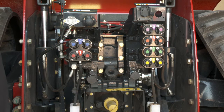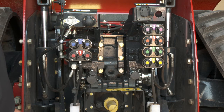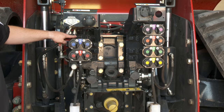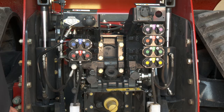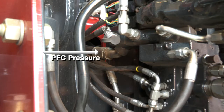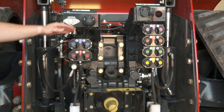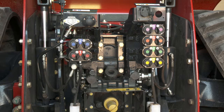We're going to take a look at the Danfoss remote valve layout. One difference compared to the Racine valves is these are in a vertical stack configuration on the left and right sides. Another difference is we have a trailer brake valve on the bottom and a hitch valve on top of the left-hand valve stack — on the Racine remote valves, the hitch valve would be on the right-hand stack. PFC pressure from the main PFC pump supplies into that trailer brake valve, then feeds the rest of the valves in the left-hand stack, down through the center manifold, and up through the right-hand valve stack.